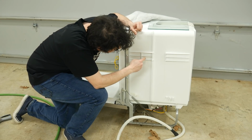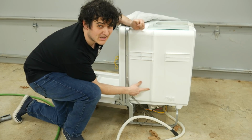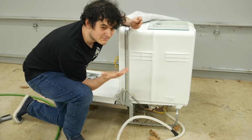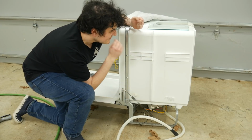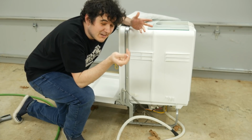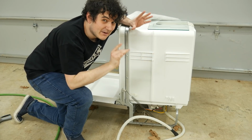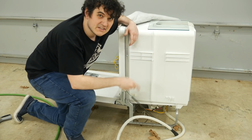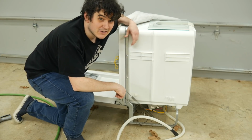But anyway, my big concern with this is this ridge here, I'm sure, is creating a lot of structural rigidity to the actual box. Now, I don't need it to be that rigid because we're deliberately destroying this and it doesn't work right anyway. But I'm going to need to cut through this, so we'll see how that goes. My plan is simply to install these screws well enough and see if they will hold the glass. So put the screws in first, then if I did that right, cut a hole inside of those squares, put a ton of silicone on the glass and just put it on the side. So it should be pretty straightforward. Just have to see if it actually is.